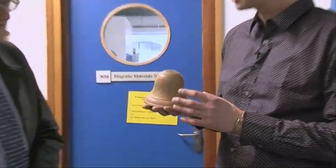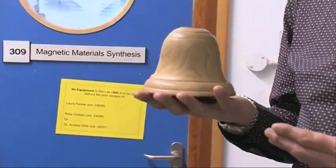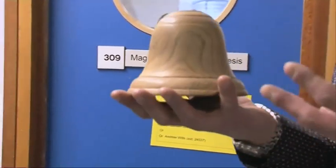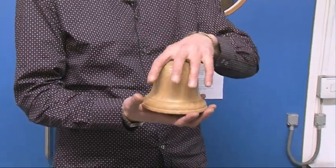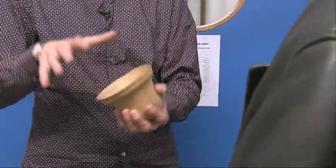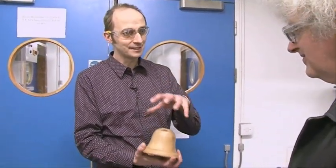A bell. And a friend of mine at King's College, Mark Mendovnik, lent me his wooden template. So what I decided to do is to actually make a mold in which I could cast a mercury bell. I cast myself a mold based on this in two halves — an upper half which did the outside and then a lower half which did the inside. And I had a beautiful sort of two halves which fit together with which I could cast the mercury.